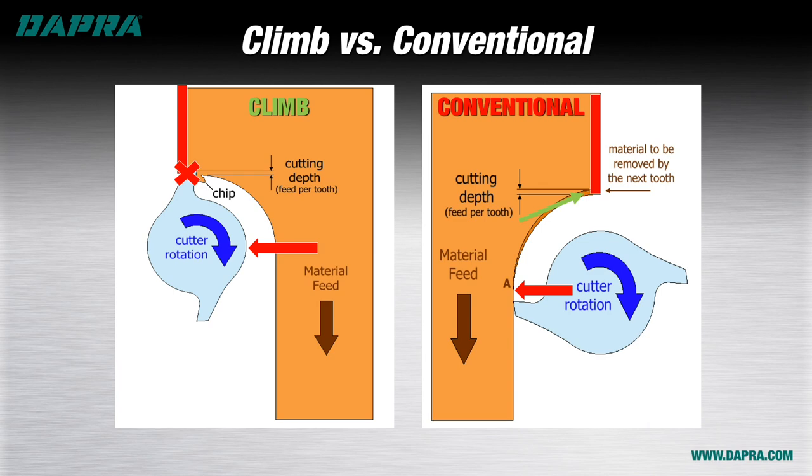This is most often noticed when a partial width of cut is being taken, perhaps less than 50% of the tool diameter. Try this next time your long reach cutter starts to squawk and no changes to speed or feed seem to help. You might be surprised.